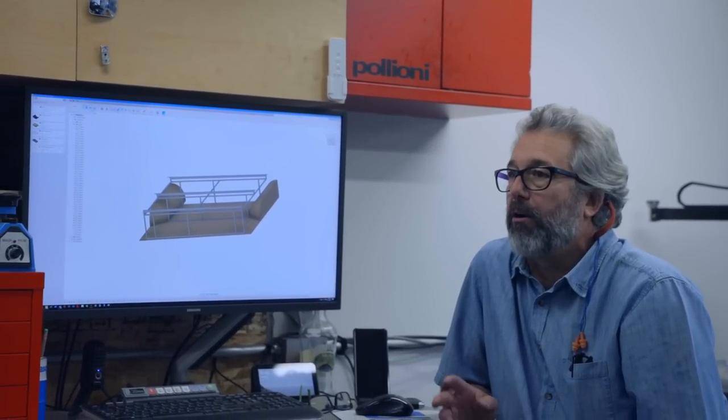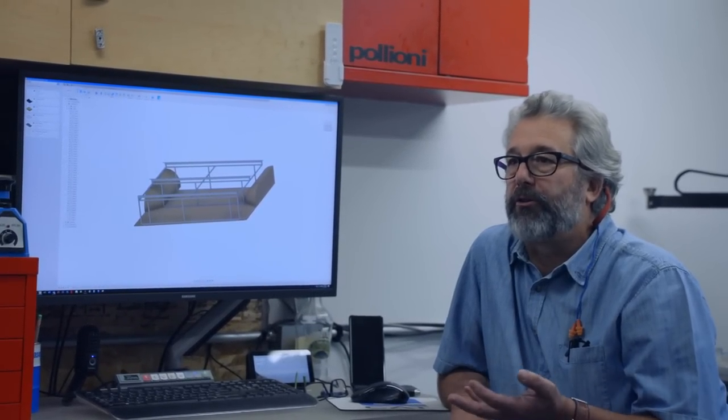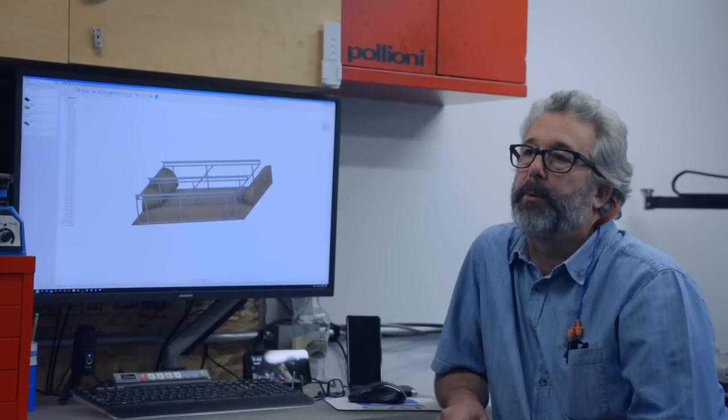Right. And looking at aluminum extrusion, that would be heavier than this. If you're building it out of 80/20 or Control Dynamics or RK Rose or any of the extruded companies, it would actually be heavier because that's a solid extrusion. This is a hollow tube. The cost of doing any kind of modular extruded aluminum setup was about four times the cost of welding it out of steel. Welding doesn't cost anything and the steel is cheap versus the expensive aluminum extrusion. The thing that kills you with aluminum extrusion is all the brackets and fabrication parts you need. We'll take a little teeny stainless plate, water jet out all our brackets, and it just costs the electricity the water jet uses and 17 cents a pound of garnet. A fraction of the price the aluminum parts would cost.